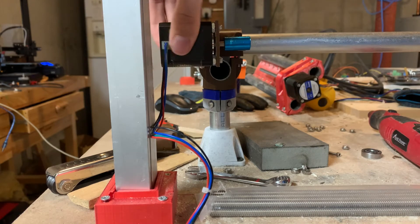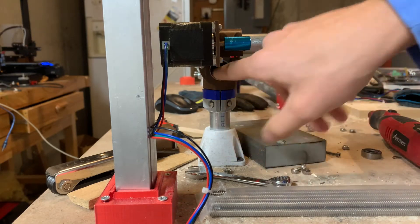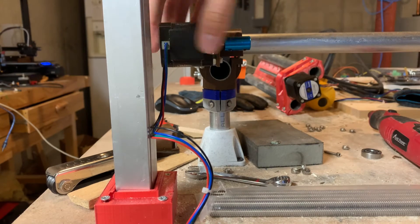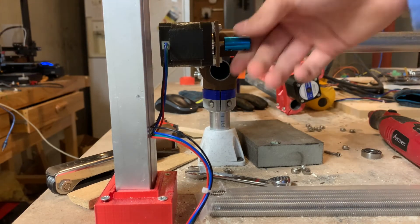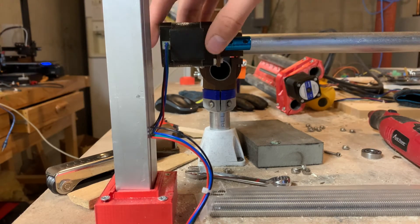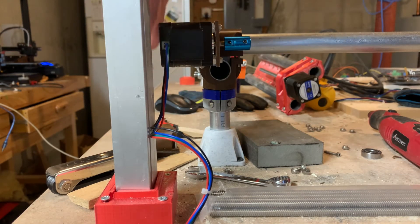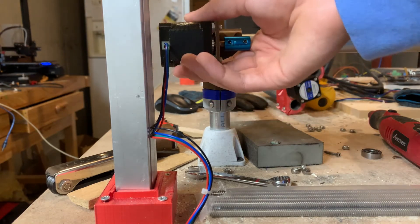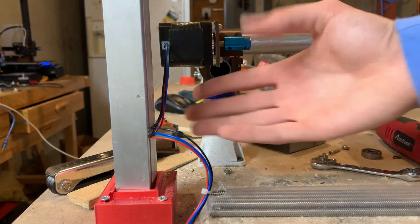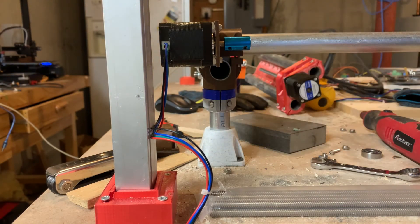What I plan to do for the new mounting solution, because it's so flimsy, is probably just have a clamp here that also clamps here. I don't want to have to remake these parts because there's really not much way that I can remake them to be more rigid — especially considering this is the side of my enclosure, it's already close to the side. If I just make a post here, like this one, that just comes up and holds this, it will be more rigid.